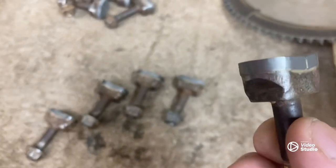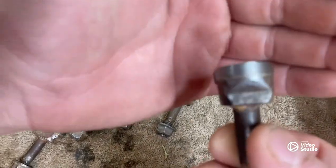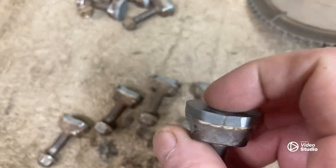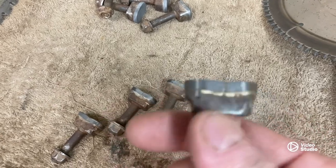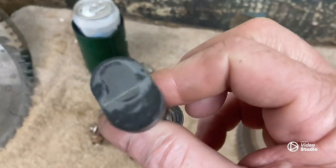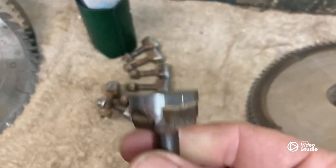Okay, finished product here. A lot of people — you really don't want to sharpen the face of these unless you have to. You just want to grind off the top. You don't want to thin that carbide up or it'll bust easy. But there you go — stump grinder teeth 101, 102, 103.